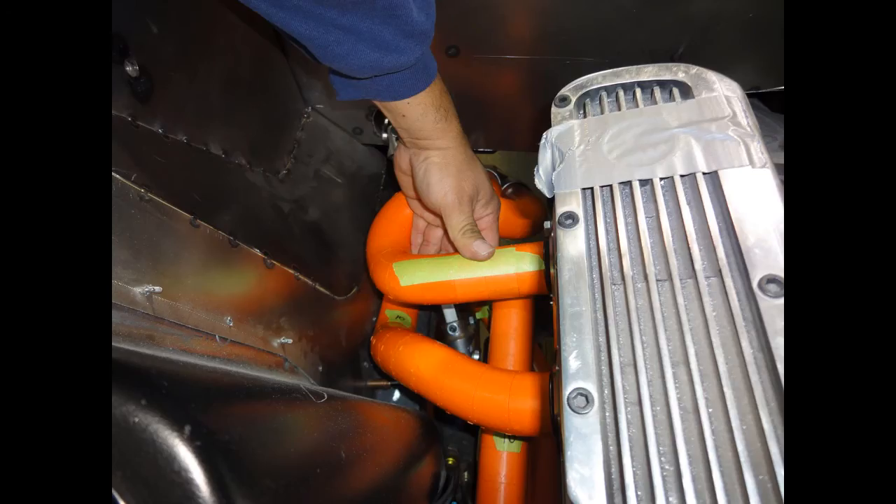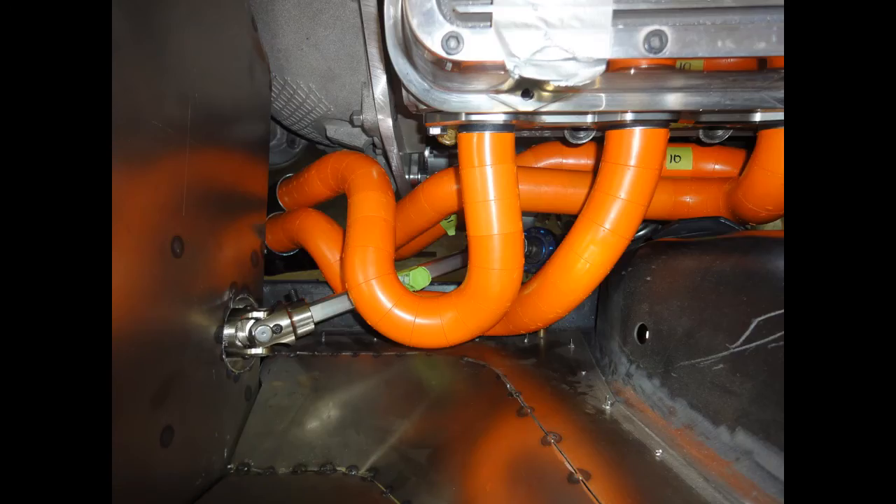In case the mockups will be sitting in your shop for a while until you can get your tubing, it may be a good idea to place tape on the tubes to be sure no movement will take place. You can also super glue them together for permanent molds when you will be using them to duplicate many sets, like in a race team situation. We taped a half spacer in place on the steering shaft to rotate it 360 degrees to be sure clearance was optimum.